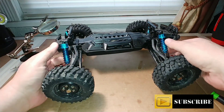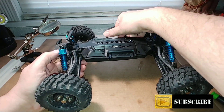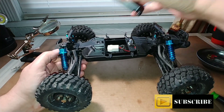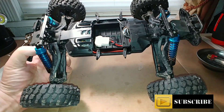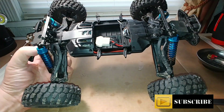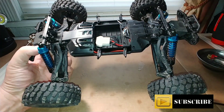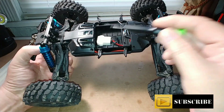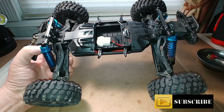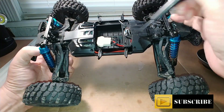We'll notice on the inside that pretty much everything is modular. What we need to do is solder wire directly to the ESC inside — I'm not going to cut and solder to the existing wire, that's just going to be too much wire hanging off, and I kind of want to save it for future use. We need to remove this top plate right here.